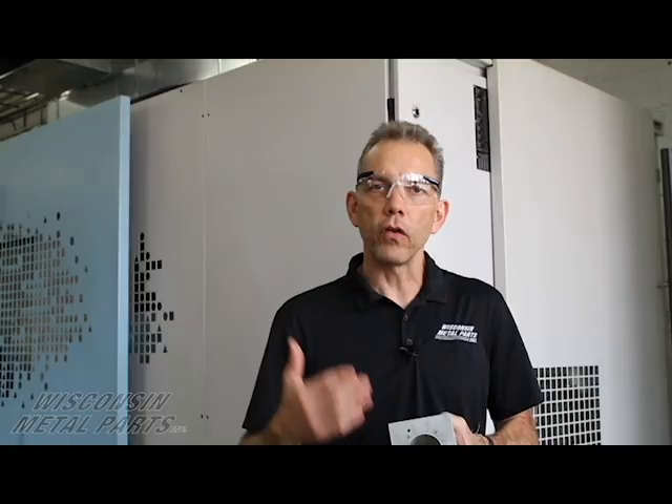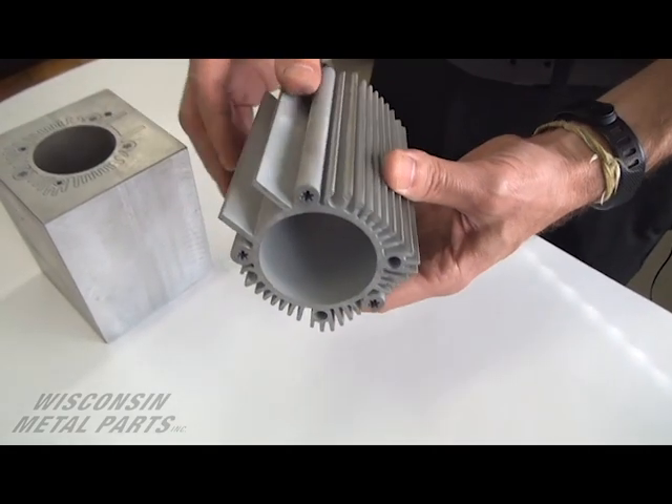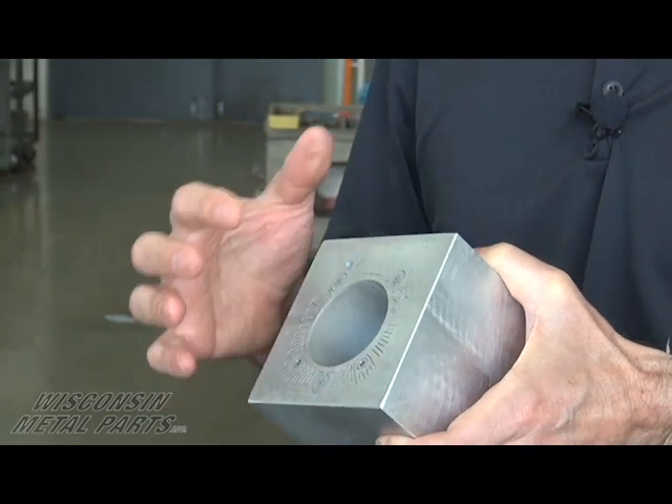Once it gets to the end you can see the part is hanging on by a little bit so that it doesn't break free, and now we would do a power change inside the software. We would lower the power, lower the flushing to a more controlled state, and we would come back and do what's called the skim pass. The more skim passes you do, the more you increase straightness, improve the tolerances you can hold, and get a better surface finish — though it also increases costs because the machine is running more. That's something decided during the quoting stage depending on your tolerances, surface finish callouts, and how tall the parts are.